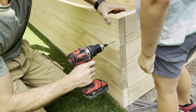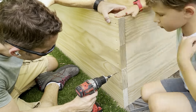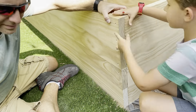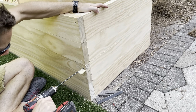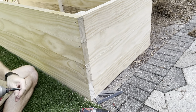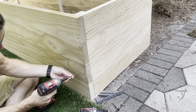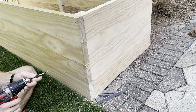Here we're pre-drilling right through — it's just a simple lap joint, and I'm putting two screws through each. I'm using number 10 three-and-a-half-inch screws, and you can see the smoke on the drill bit because this wood is so hard. I did have to get a longer drill bit to get all the way back in there because I had snapped a couple screws. Really make sure you're using the right screws — stainless steel — and pre-drill everything.